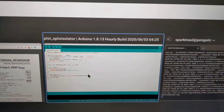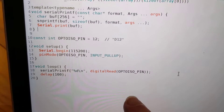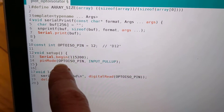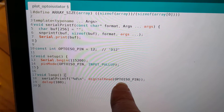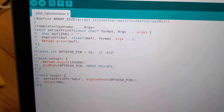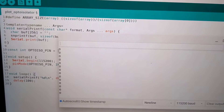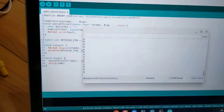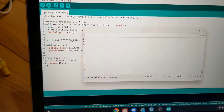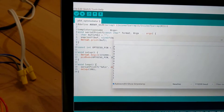The program here is just a simple demo. It sets the pin to input pull-up, does a digital read, and prints out the value every 100 milliseconds. Looking at the output: because I have the AC input connected, it's spitting out zeros. When I disconnect it, it goes back to 1. I can just touch it and release it — so yeah, that's the 10k resistor.